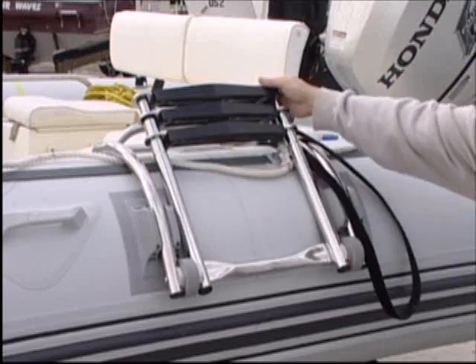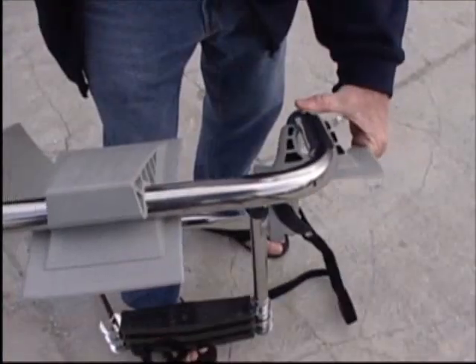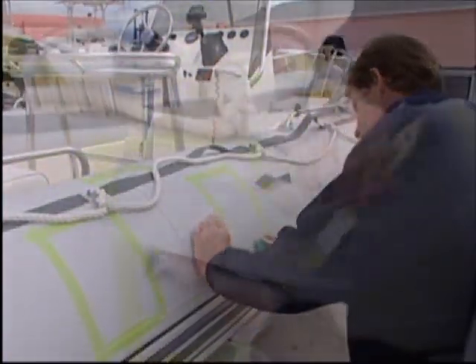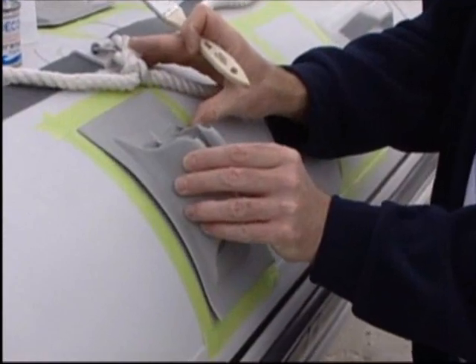The answer? The award-winning Armstrong Rib Ladder. Simply attach the frame to the mounts and place on the side of the boat. Outline where the mounts land. Scuff with 120 grit sandpaper. Glue the three rubber landing mounts in place. Once dry, this ladder holds up to 400 pounds.